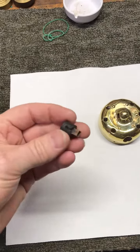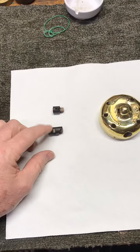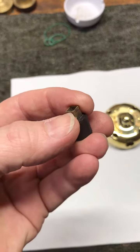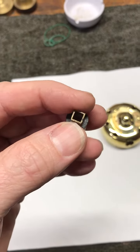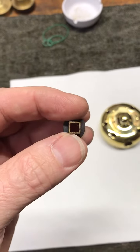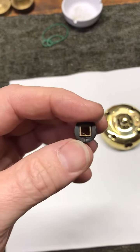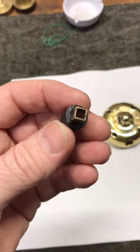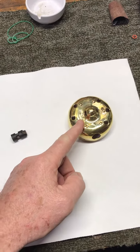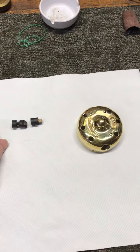This is all that was left of that one side, so I'm going to make a new pair of insulators to go around the original brush sleeve. I've got square tubing sleeves here in case anybody's got one that's missing them altogether, but this one happened to have the original, so we're going to use it. I'm just going to make the new insulator pieces to go around them and install them in this end bell. That's all for now — we'll post this to YouTube as part one.